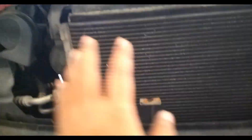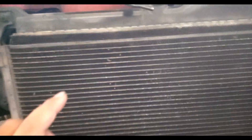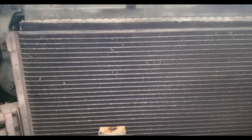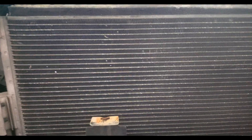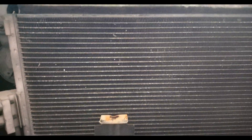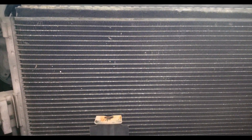This will serve as our baseline — as you can see there are bugs and all. The condenser should be cleaned at least every six months, or depending on where you're at. If you're more in the province, it should be cleaned at least twice every three months.